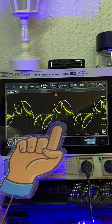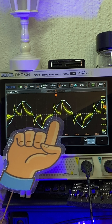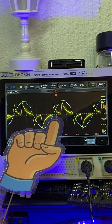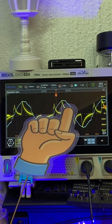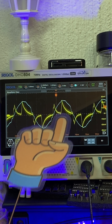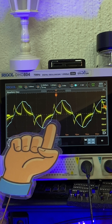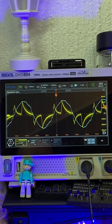There's your notch — we are at full voltage — which is caused by that current spike. Then there's a second one over there, but it's at the crest. However, this one at the zero crossing point, that one is not good. So this has added a bit more context to my previous video by adding an inductor.